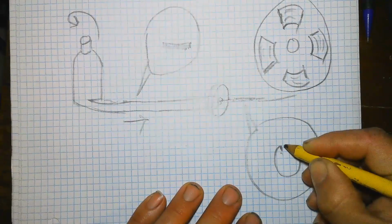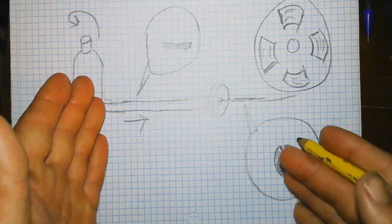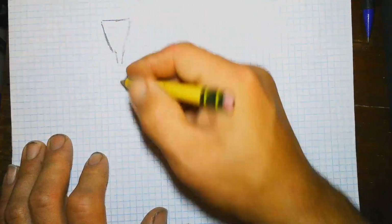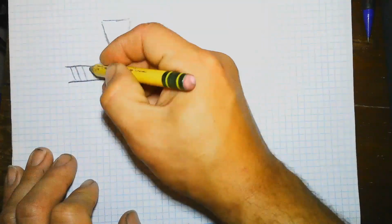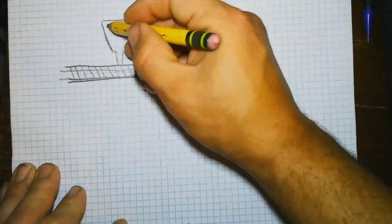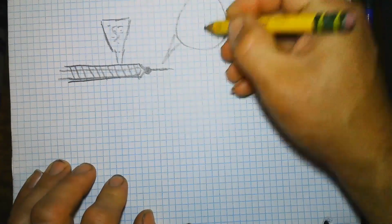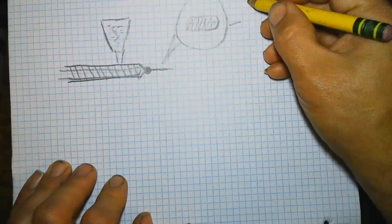So I came up with an idea, a hybrid approach that hopefully could be scalable and maybe even better suited to recycling. I hypothesize that the reliability of that bottle filament is the result of the cutting process providing an extremely consistent volume per linear length by virtue of cutting a rectangular cross section from cold plastic, as opposed to trying to walk the tightrope balancing fluid dynamics, temperatures, extrusion rates, and the speed of the outfeed roller to try and get a consistent round diameter out of a conventional extrusion system.